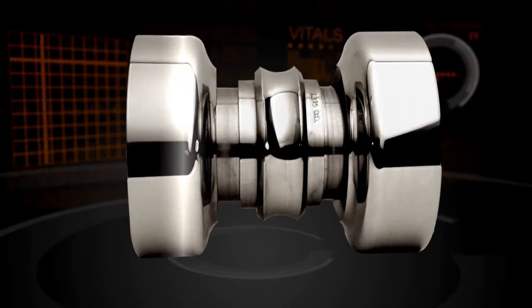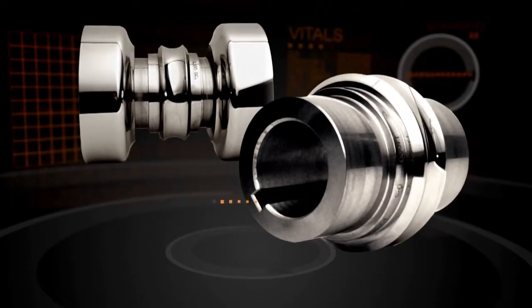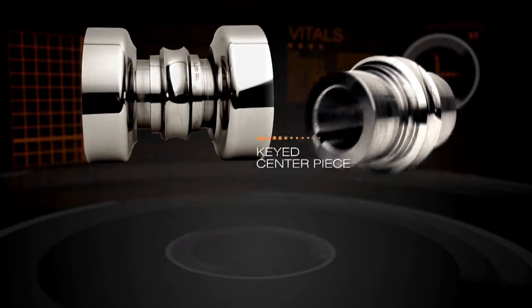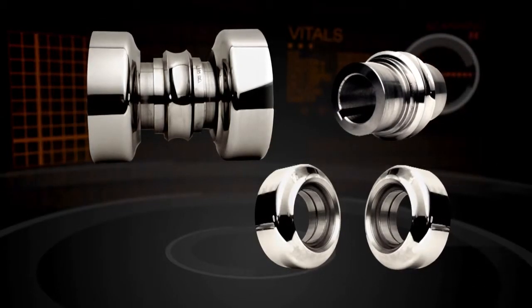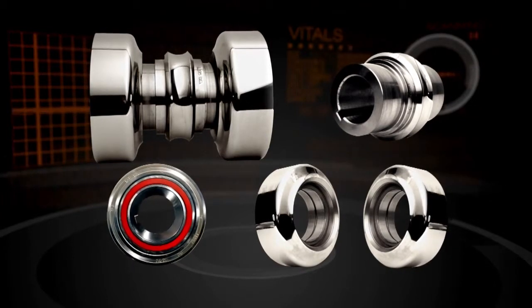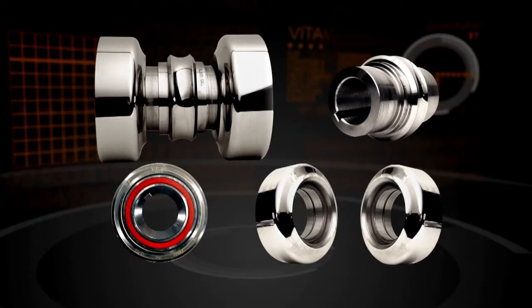A Roll Craft Floating Flange Roll is designed in several pieces, with the centerpiece keyed so it's turning at the speed of the mill and the two outside rolls spinning freely. This enables them to turn at the speed of the material being formed, allowing the material and outside rolls to spin at the same speed, eliminating roll marks.